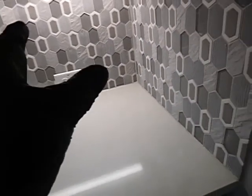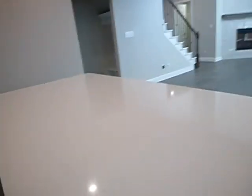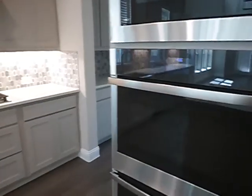Every kitchen is supposed to have two circuits. So this one receptacle meets that need because it's part of the dining room circuit. I'm not sure that's the intent of the code. Then the rest of these receptacle outlets are on their own kitchen circuit. Now the refrigerator is supposed to have its own receptacle, not circuit, receptacle. The refrigerator could be on this circuit, that circuit, I guess. But it's on its own circuit. So it's independent. It's not GFCI protected either, by the way. So I'm not sure what that's about.